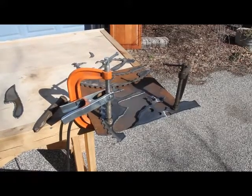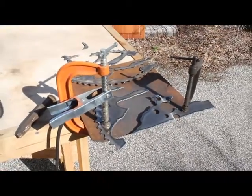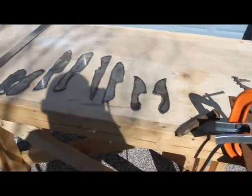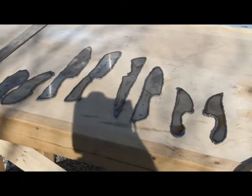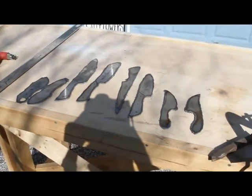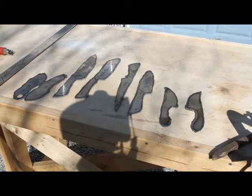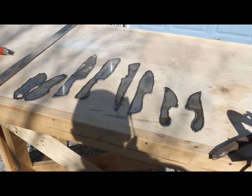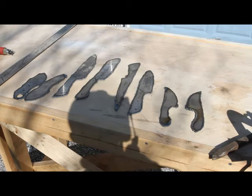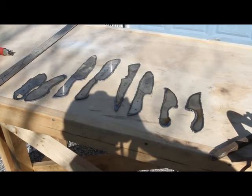Here's what's left of the saw blade — made pretty good use of that, not a whole lot of scrap. This is pretty much what we got out of the material. They're not perfect cuts, but they're way better than trying to do this by hand with a grinder. It just takes a little bit of cleanup on the grinder downstairs — the 2x72 Grizzly with some 36 grit — and we'll have those things all profiled and ready to start putting edges on them. That's about it for the plasma portion.